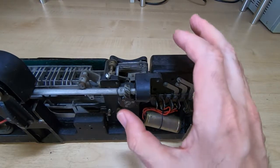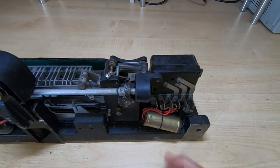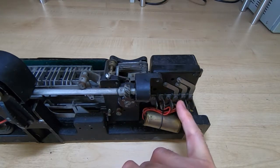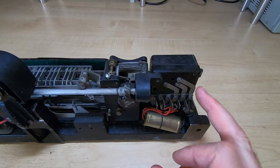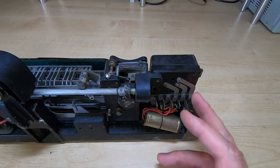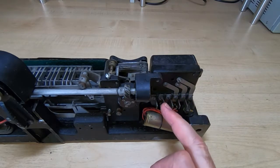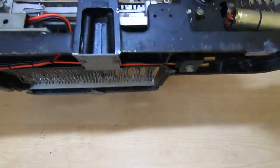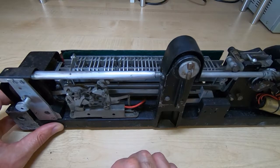On this end we have the transmitter. It's a self-contained unit, fed by five rods and levers on the keyboard itself. The interface between the entire keyboard and the rest of the teleprinter is just through these six contacts, which feeds data out of the transmitter and into the teleprinter. There are two signals that come out of here: one is the actual data being transmitted, and the other is the start-stop information to start and stop the process within the teleprinter. On the bottom there's also another electrical connector, just for the warning light — an optional add-on not required for the machine to work.